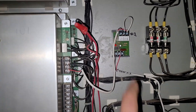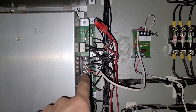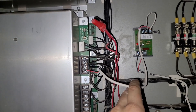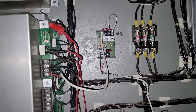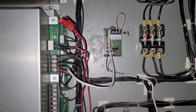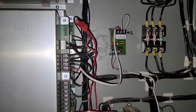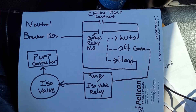We've also added a dry contact chiller start-stop on terminals three and four — they used to just have a jumper there. We've got it jumped until we get the DISTEC controller up and running. They used to be controlled by the COM cards which are here, but we've opted to simplify things with the dry contact remote enable. So here's what it looks like on paper.